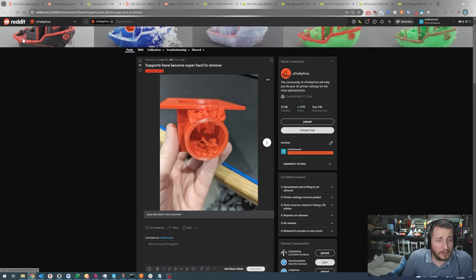If these are the same settings you've used on other filament, I'm more likely to blame the filament than anything else. If you try with a different filament and it works fine, I can absolutely point my finger at the material. It's not very common that red filament requires significantly more or less heat — black and white seem to be the only two that really need a little more fine tuning. So if you can up your cooling, that might help. PLA+ should run close to PLA temps, maybe an extra 5°C more if needed.